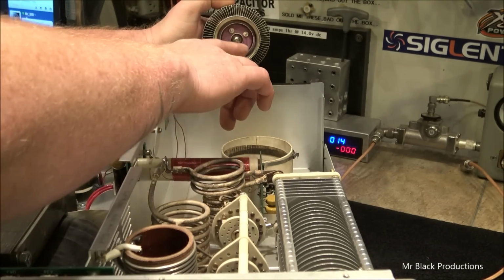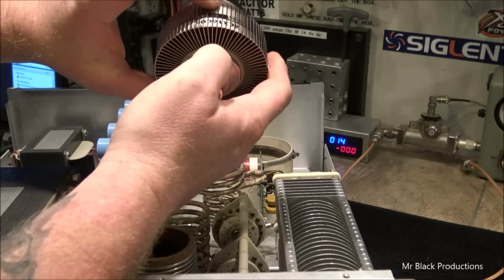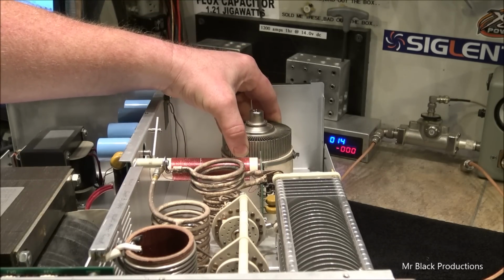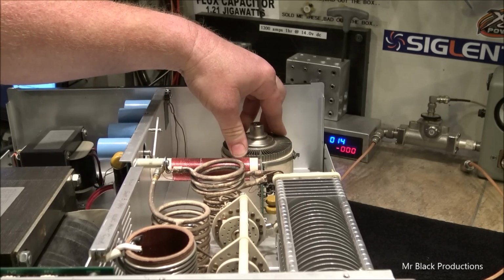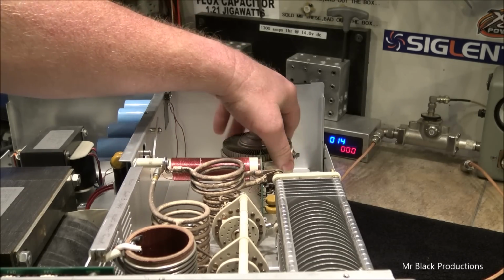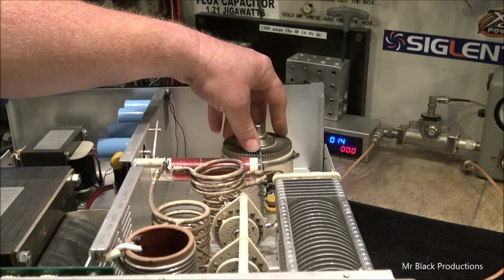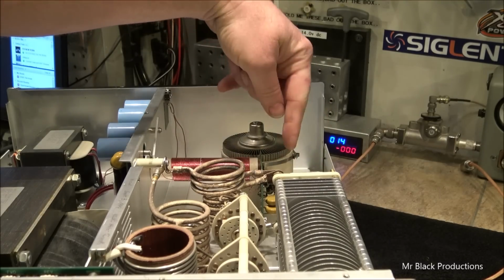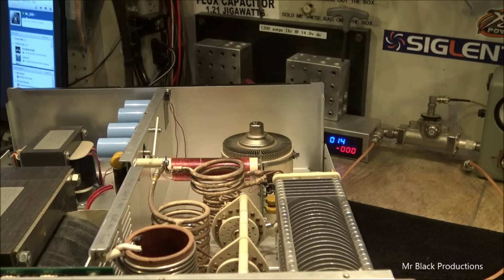So we're orienting this so the pin faces the back wall. Otherwise the writing also faces the back wall. We drop it straight in. Just like that. End of story. Then you're going to tighten down this strap that's on the side, a mechanical metal zip tie. The inside of this cardboard tube has the anode pickup on it, which is a piece of copper. It comes directly off the parasitic board. Very important, you don't rotate the tube.